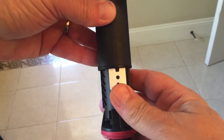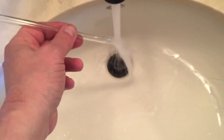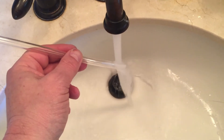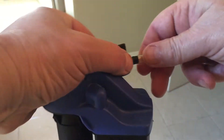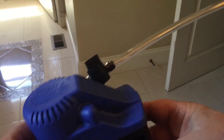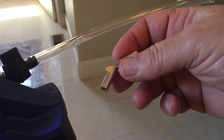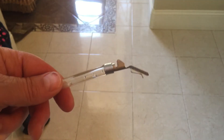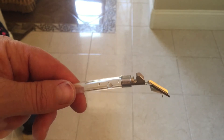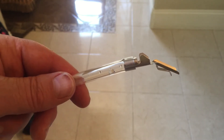Now I'm going to install the tube. I'll run it under hot water as recommended — that softens it up. I'll slide this on here, then add this metal piece that slides onto the filler tube or overflow tube. Heat up the other end and slide it on as well. I recommend you warm it up like they say — I tried it without doing it and it was very hard to get on; warmed it up and it slid right on.